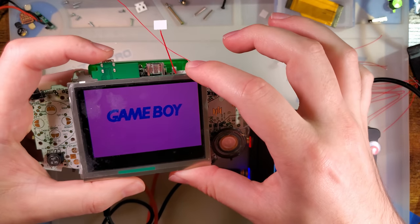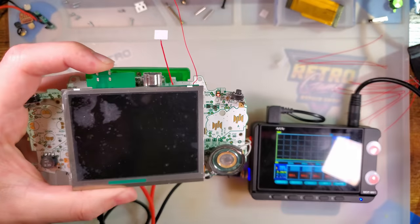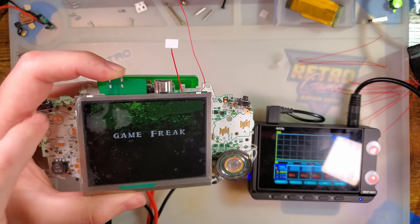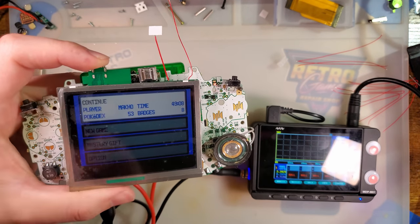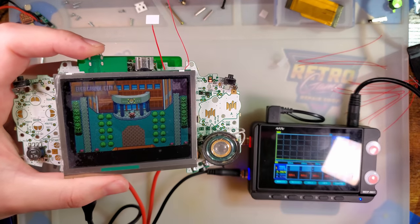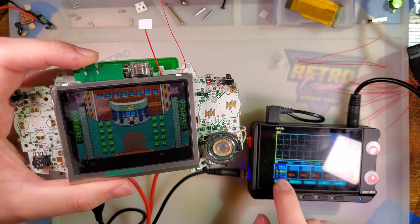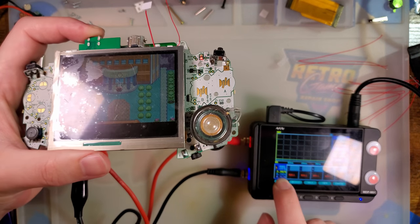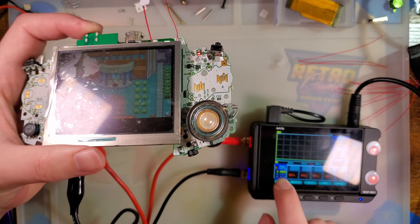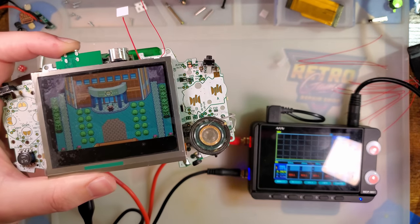And hey, it kind of works. Oh. That's their color filters, yay. Okay. Let me get that in game there. And in the exact same place it usually is. Same everything, but with the backlight kit, we are pulling at 2.4 volts, 288 to 290 to 303 milliamps.